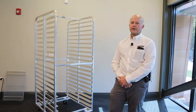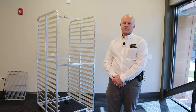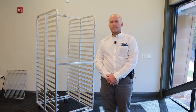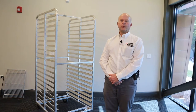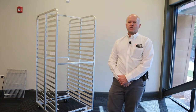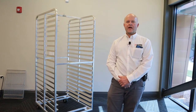These racks are also rectangular prisms with the exception that the design allows for the collapsing or flat packing of the major components. There are two benefits of this design: one, it allows the customer to assemble the racks, saving the manufacturing cost of a factory assembled unit; and two, it allows shipment of a more densely packaged product to save on shipping costs. These two reasons are not always benefits, however, as bolt together designs also have a weakness.